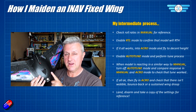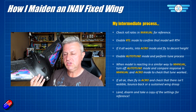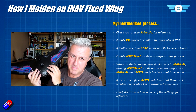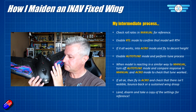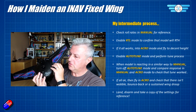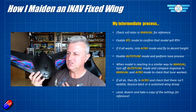To tune, I'll put the model into acro mode — the default mode with no stabilisation selected — and then enable auto tune. I'll fly and flick the model from side to side about 20 times. Initially it will feel quite mushy, but it will get better and better. Then I'll flick the nose up and down 20 times, then go back and do each axis at least one more round. At the end of that, it should be flying quite nicely — that tunes both the feed forward and the rates. Once happy, I'll turn off auto tune and go back into manual mode to compare the acro and manual settings. If they feel very similar, the tune is good. I'll then pop it back into horizon mode, bring it in to land, and disarm. All those settings will be saved to the model.